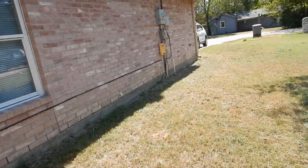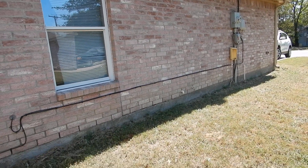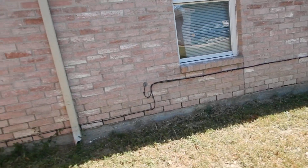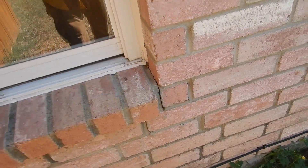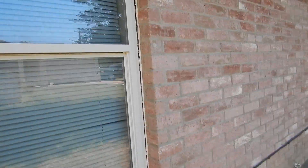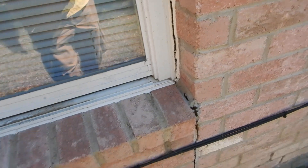You've got this much brick, and we're in North Texas with expansive clay soil. Expansion and contraction — we know it's going to crack. So we want these control joints to kind of control that cracking. And then we've got a little more cracking right in here.